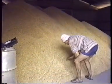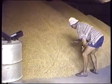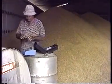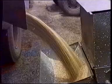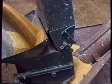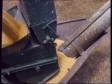Stored grain can be protected with inert dusts for 12 months or more. It must not be more than 12% moisture content for wheat and coarse grains, or 14% for paddy rice. Even application is vital to make sure all the grain is coated with dust; otherwise insects might survive in untreated zones.